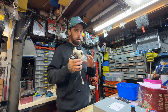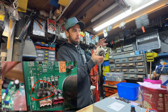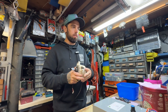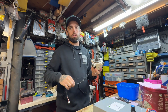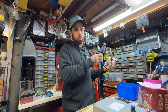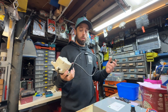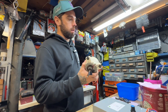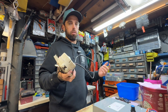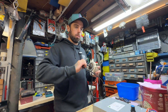Sometimes you go to a unit where the outdoor PCB has a fault and isn't working — you don't know if it's also damaged the PCB inside the fan motor. It's not as easy as just going to the board and checking for voltage; it's a bit of a mystery. A lot of manufacturers say if you're replacing the outdoor PCB, just spend the extra money and replace the fan motors too, to be safe. The problem is they're not cheap — probably about $150, not including shipping, taxes, and labor.